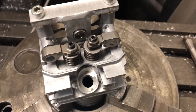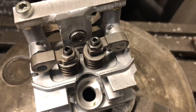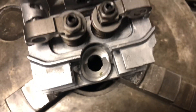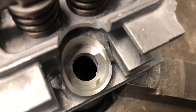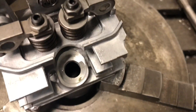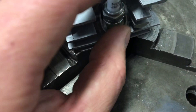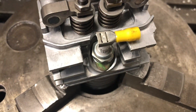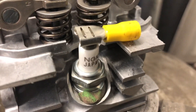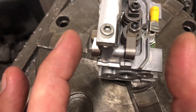This is showing a cam bearing support — that bearing there — a small needle roller, because the camshaft goes straight through there. I've had to re-drill the spark plug hole on this test valve; I'm now thinking I need to make the spark plug upright. The plasticine is just to hold it in place — that would be an upright plug. I need to make some kind of spark plug cap.